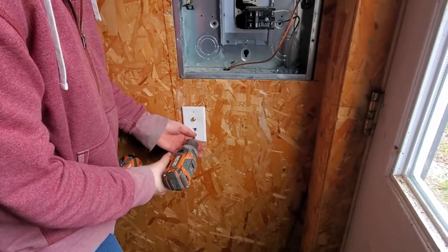If I were to put in a 14 gauge wire behind this 20 amp circuit, that wire can overheat and burn up and even burn down the garage. So you want to have an understanding of amperages and how different circuits are rated.